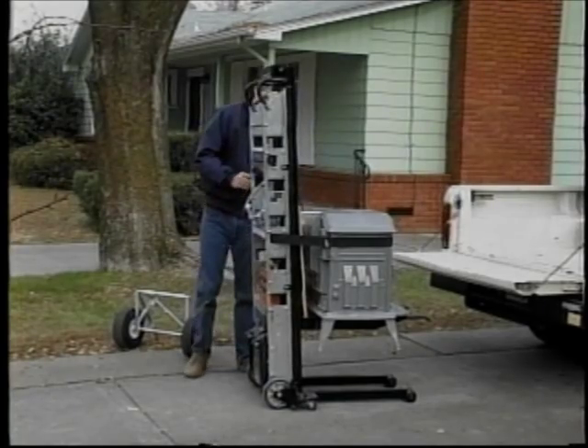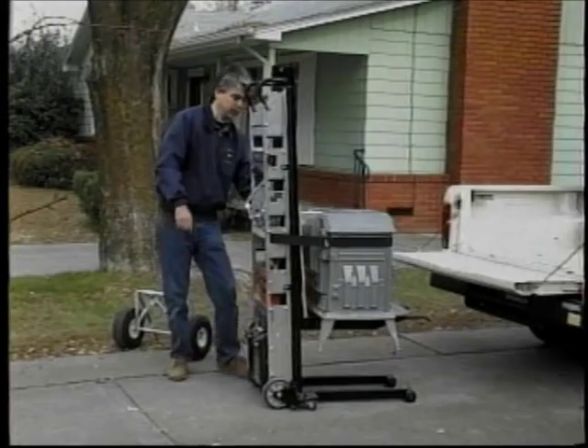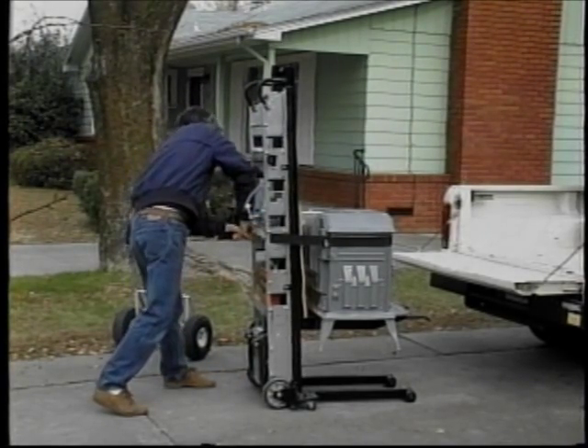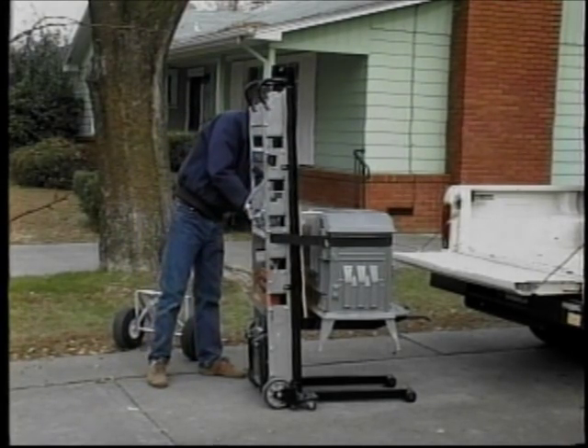You simply bring the strap out around the stove, put the buckle right at the side, latch the other part of the buckle, push down the locking pin, and then cinch the belt up very tightly. I've used a piece of plywood at the back of the wood stove to protect the porcelain finish.